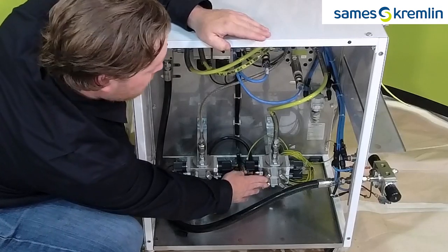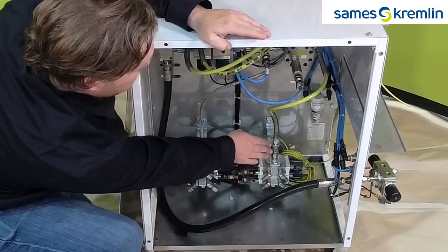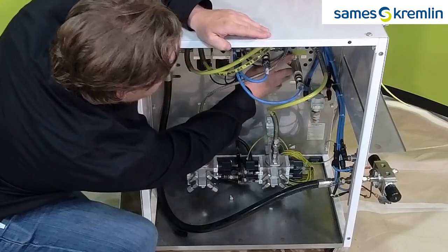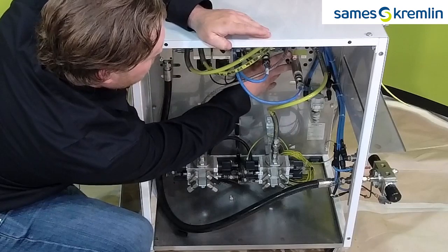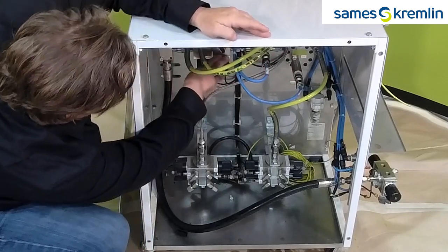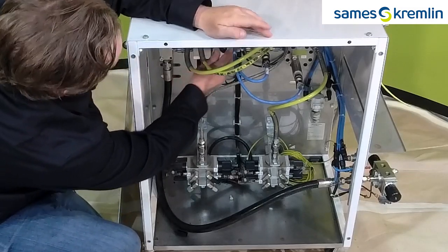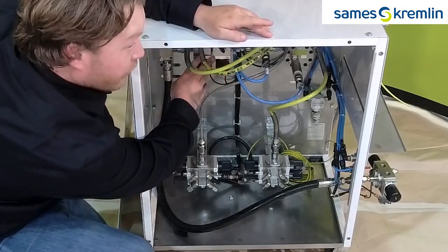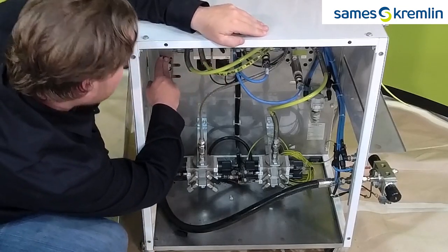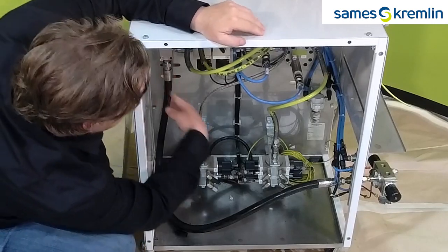Whichever base material is selected, depending on our recipe, the material travels up through a high pressure hose into our component A flow meter, through another check valve here, through a series of valves. These are pass-through series of valves that are used for ratio testing and flushing, into our mix block. Now this mix block is again where our resin and our catalyst materials meet for the first time.